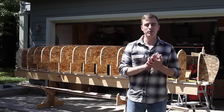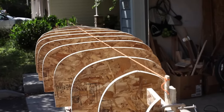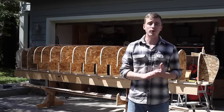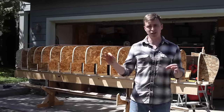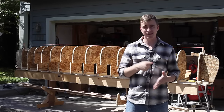So that's how I set up my molds to build a cedar strip canoe. I really take my time to make sure everything is cut and mounted as perfectly as possible. The better you set yourself up in these early stages, the less trouble you're going to have down the road. Also, it's important to remember to put masking tape along the edges of your molds before you start gluing the cedar strips on — otherwise you're going to accidentally glue your cedar strips to the molds. Thanks for watching A Guy Doing Stuff. Don't forget to hit subscribe.